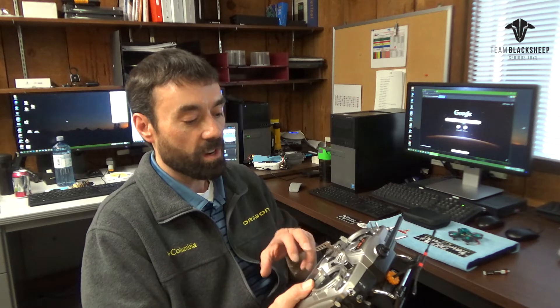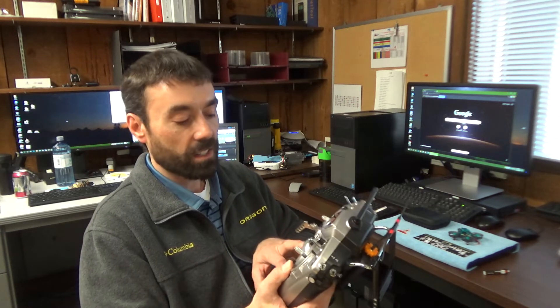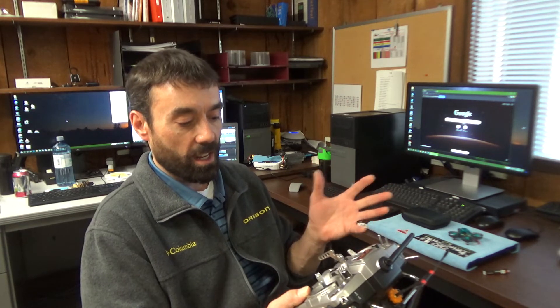Your RSSI, link quality — if you have Crossfire, which I have on my 5-inch quads, I put RSSI and link quality on here. I just like seeing it when I power up to make sure everything looks good. You can even have RPM, current — pretty much any of those sensors you see under the sensor screen you can put on here. I've been playing a bit with long range quads, and if you have a GPS chip on there, you can have GPS sent through your telemetry.